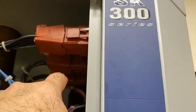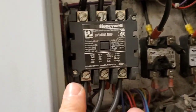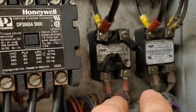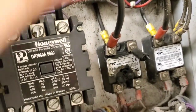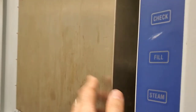Before we remove the tank, we need to take the wiring off — it's all plug-ins which makes it easy — and we want to verify there's no power. While doing this, we found that the relay is burnt up. This is a solid-state relay that pulses current to the heaters, and it's burnt up with the wires pulled off. We'll have to rectify this once we clean these before we can turn it back on, but in the meantime we'll pull it out, clean it up, and check power beforehand.